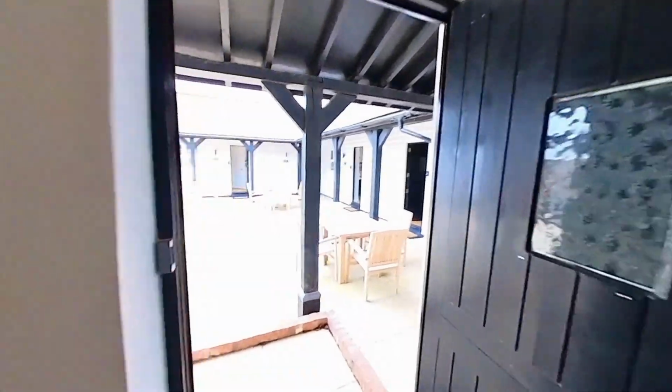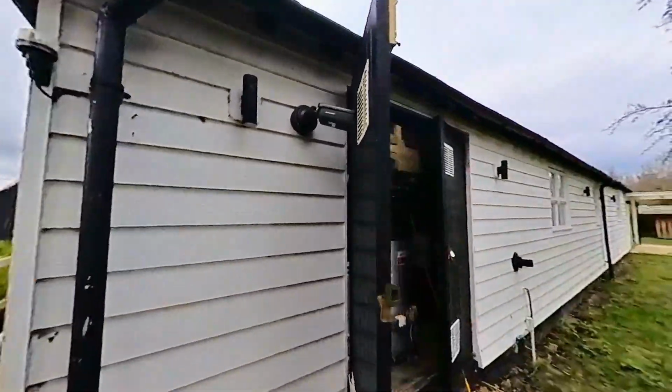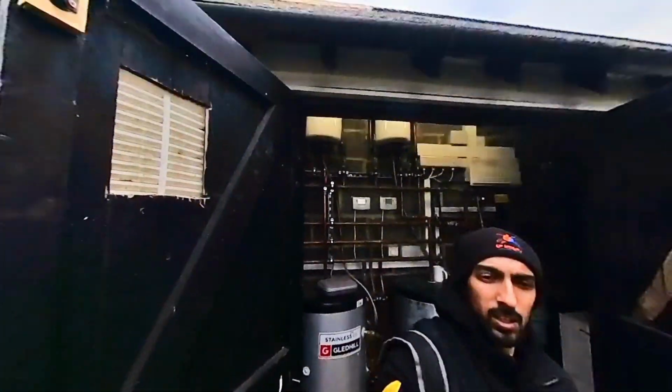Right, I am going to make my way to the plant room and do what I do best, which is the wiring, which in all fairness doesn't seem too difficult. I've had a look at the inside of this receiver box, and it's just like a combi boiler wireless thermostat. Just got live and neutral, got to put a link in between the live and the common, and then there's the plant room. Beautiful, beautiful.